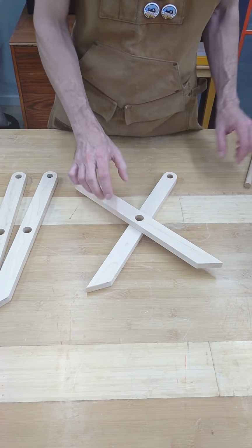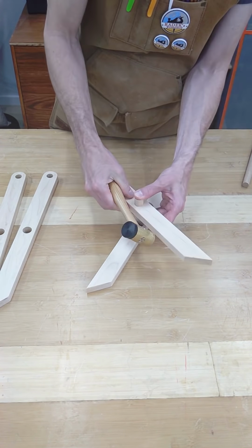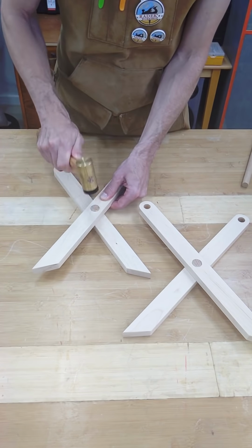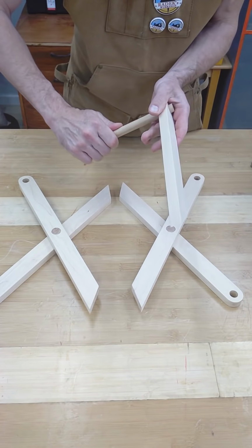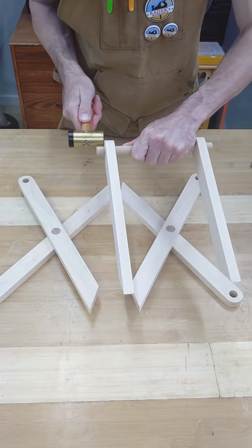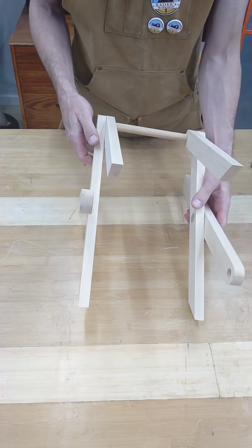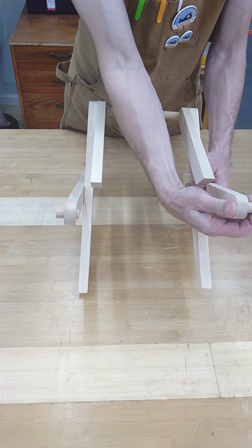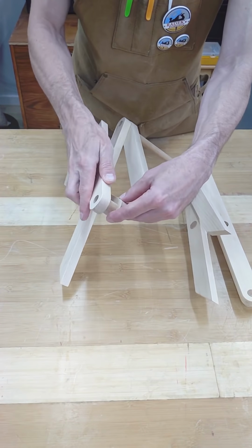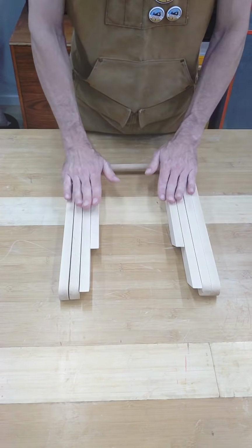Assembly should start from legs, which we are connecting using thick dowels. There is no need for glue here, dowels should fit tightly in holes. Long dowel connects inside brackets with legs. It is also a handle to carry the stool around. As you can see, one of my dowels doesn't fit too tightly, but after gluing the whole thing up, everything should be okay. Short, thin dowels go to the second pair of legs and outside brackets.